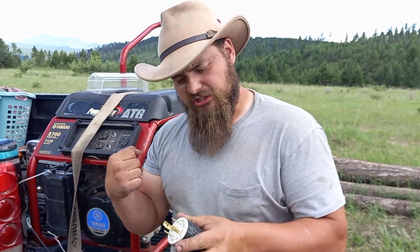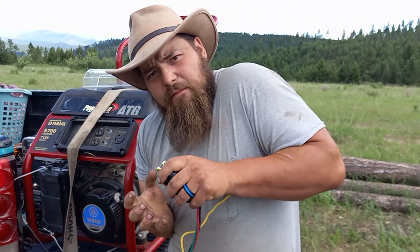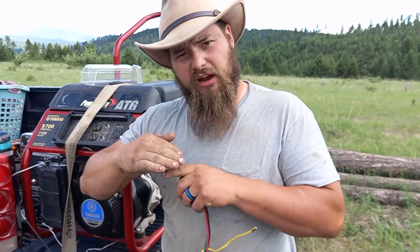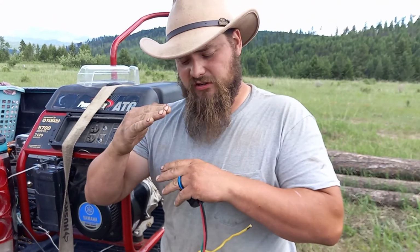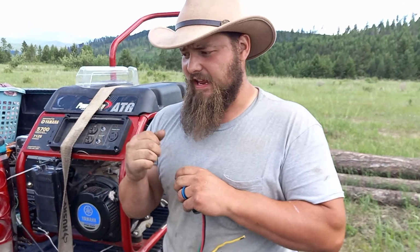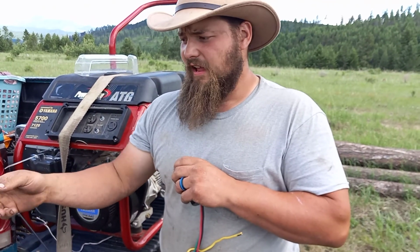Now, one advice that the guy at the well store gave us is that a well pump, when you turn it on, immediately generates pressure. And if you leave your frost-free bib closed, you don't want to back it up. You don't want to leave your hose closed for that well without a pressure sensor. You can put in a pressure sensor switch which doesn't let that pump just take off and start pumping like crazy, and it saves your pump. But we don't have a pressure sensor on this well, and so